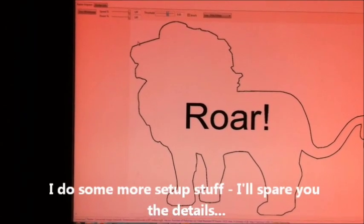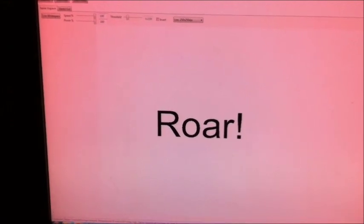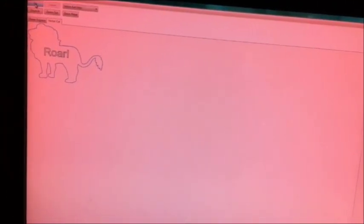We're looking at the raster engrave view and we can see both the lion and 'RAR' in there. We'll do the raster engraving first — I think everything's lined up, so let's hit Go and see what happens. Then we go ahead and do the vector cut, which is a second operation off the same print job. Everything should be aligned automatically; cut speed and power are set up with two repeats, so let's click Go.